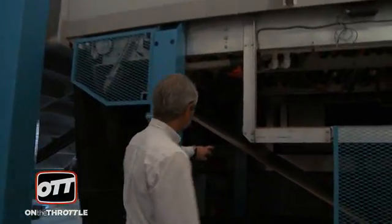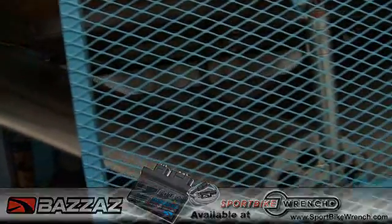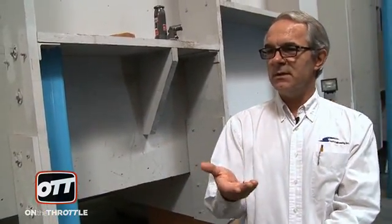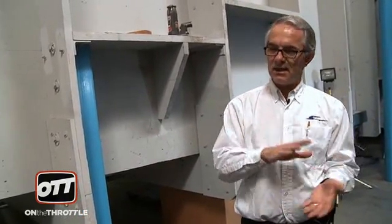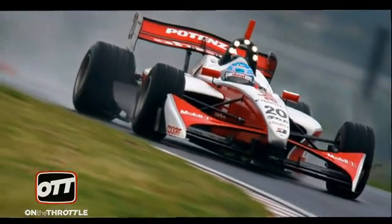This is the moving ground plane. It's like a big belt sander, controlled by guidance rollers and sensors sensing the edge of the belt. We can run the tunnel up to 140 miles an hour — so the air moves at 140 miles an hour and the moving ground plane moves at 140. When a car drives down the road in still air, there's no relative motion between the ground and the air. When you test in a wind tunnel, the model is still and the air moves, so you move the ground at the same speed as the air to replicate that condition. On a car with low ground clearance like a race car, the airflow under the car is very much influenced by the fact that the car moves over the ground as well as through the air.